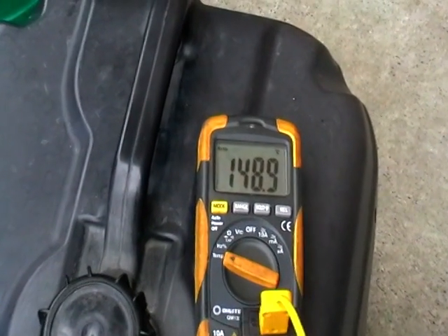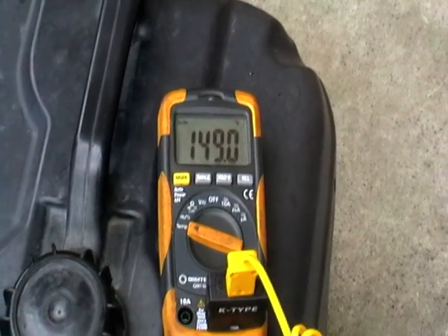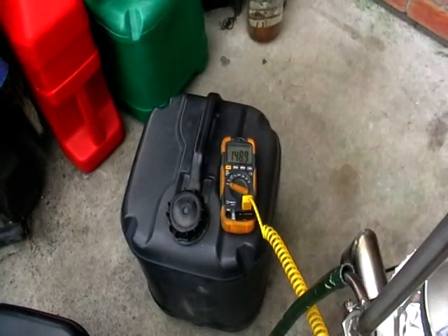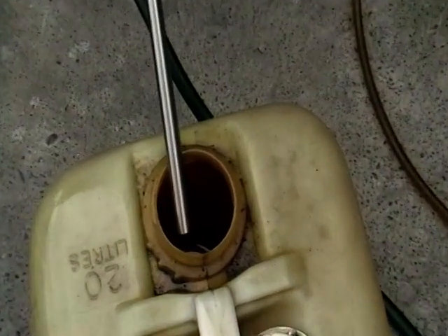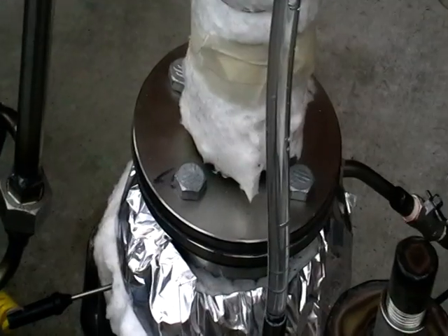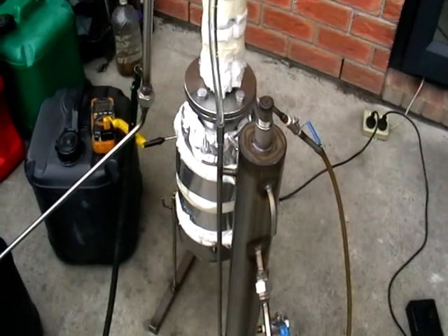And this is actually the temperature of the vapor within the reactor. The temperature of boiling is much higher, so it's just enough for the petrol to be separated, evaporated, and the diesel to be removed. It's all solid construction — there's a big flange, bolts, nuts — everything's made out of stainless steel.